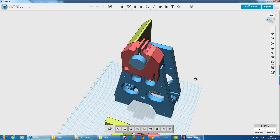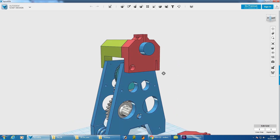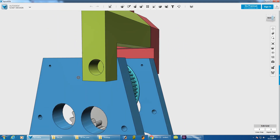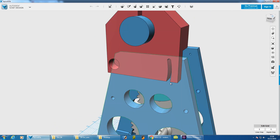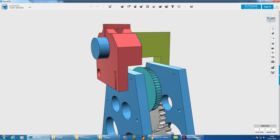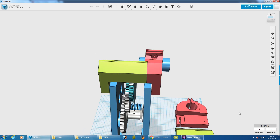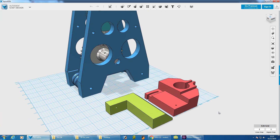I just need to make a motor mount to sit on top of the gearbox. I'm going to design something that clamps the motor with a nut and bolt, and is adjustable for belt tension. There's a pivot on these holes, and on the other side there'll be 4mm studding with a nut and bolt to adjust by pivoting around that point. That'll be two pieces solvent welded together, printed in ABS, and then we can fit the motor.